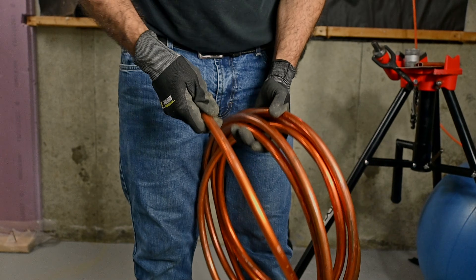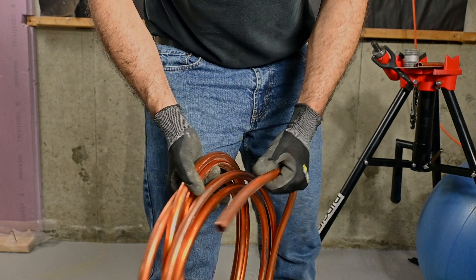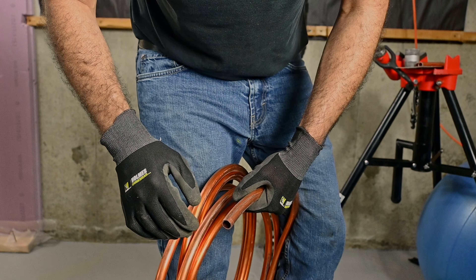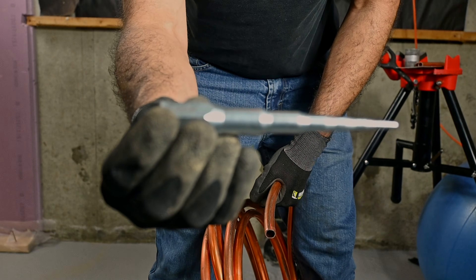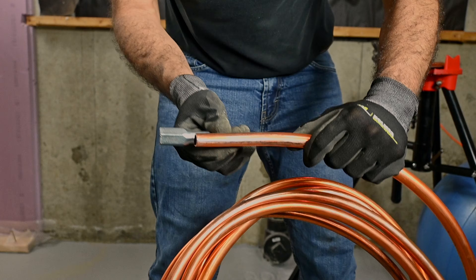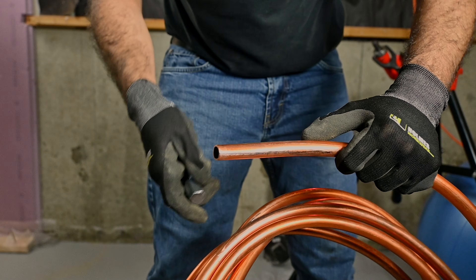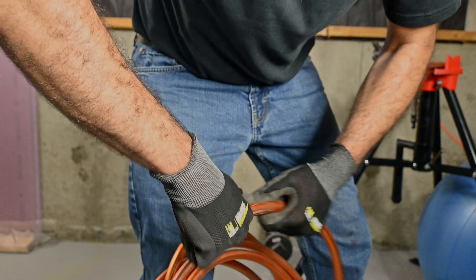We're going to move the camera a little lower so you get a better view of the swaging process. Because more often than not, when we swage, we're doing it lower down near our legs. So if you're doing that and you're swinging a hammer, make sure you don't miss — otherwise you might end up with bigger problems than a missing coupling. Also note how long the swaging tool is. The bigger the size, the deeper you need to go. So if you have a bend in the pipe, the swaging tool could hit the pipe walls and kink it. Before you swage, make sure whatever depth the tool is going in, your pipe is fairly straight.